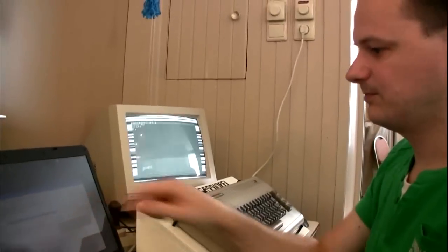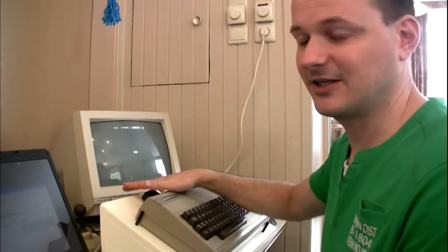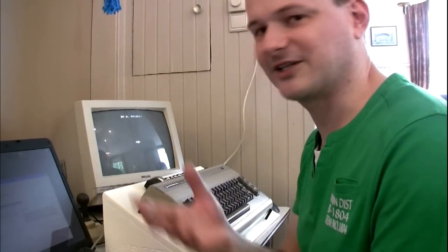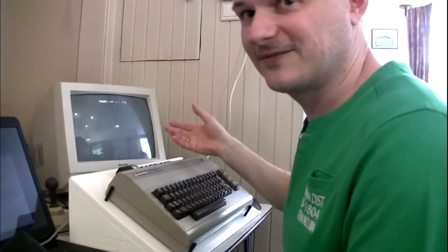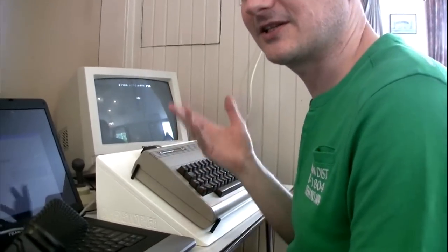And then it will load the file. And it didn't load it from flash. It loaded it from the hard disk over here. So that's very convenient if you are a programmer, because if you're programming something, it's never right the first time. Otherwise you would need to upload it to flash, load it, then erase it again, reprogram. So now you can skip some steps and test it.